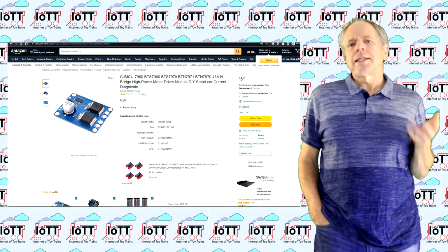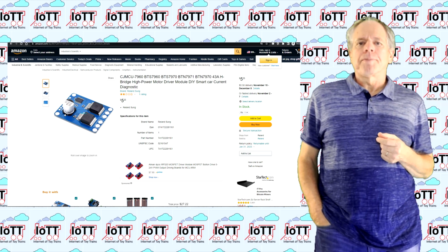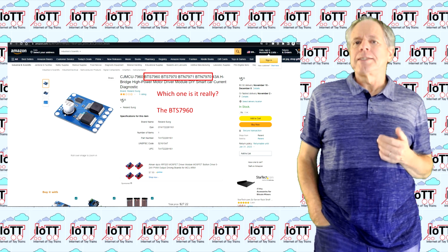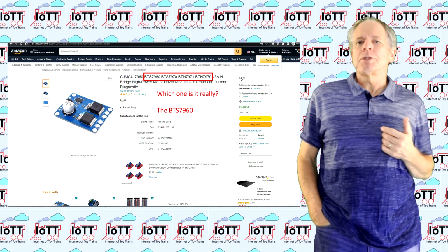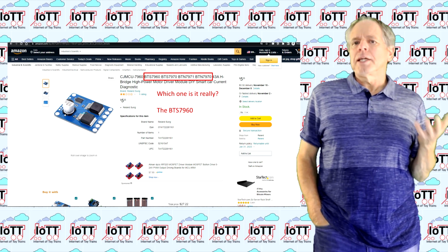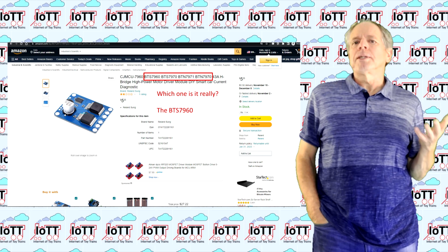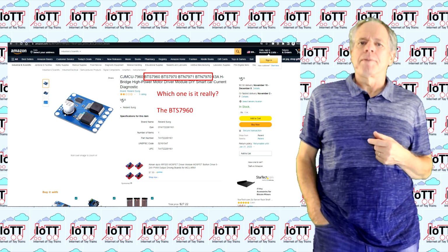The second module I tested is a similar one, but without the dominant cooling block. The description on Amazon is slightly misleading as it references both the BTS7960 as well as the BTN7970 chips as H Bridge chips for the board. Well, when I ordered the modules, I hoped they would come with the BTN7970, as the BTS7960 is no longer produced, but the devices I received had the BTS7960 chip installed.